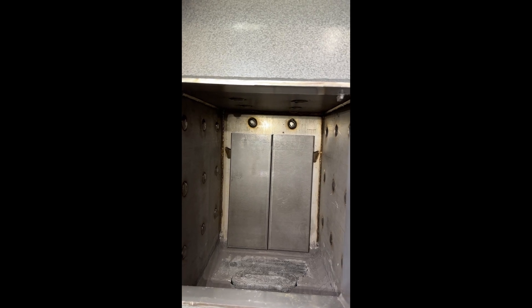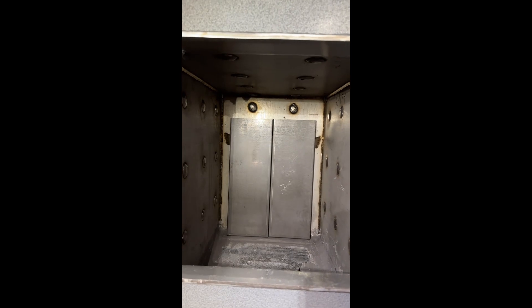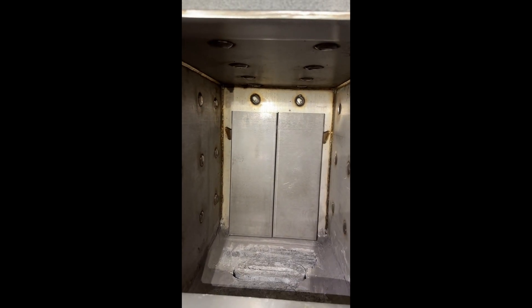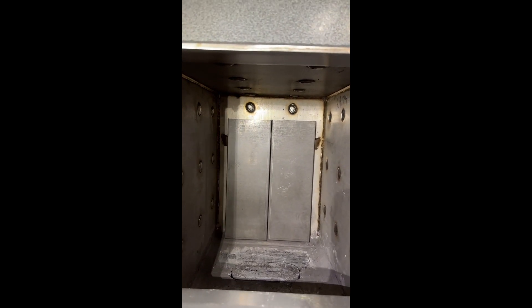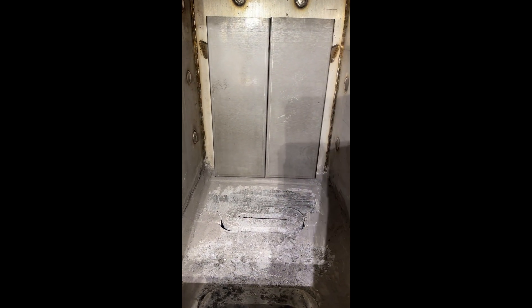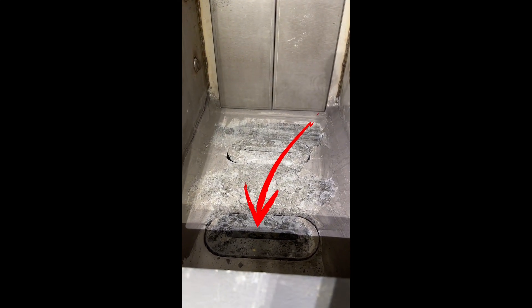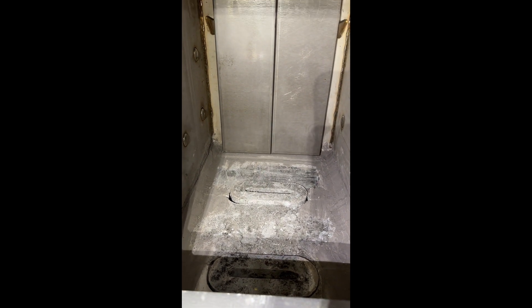There's an inlet behind those diverters from the back of the boiler, and the air comes up over top of the fire. So the fire actually burns upside down, and then the air is sucked down into the center brick below. You'll see those two bricks there with the slots in them, and from there it goes down into our burn chamber.